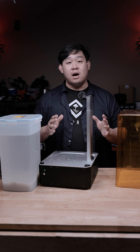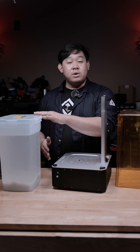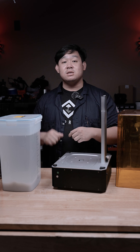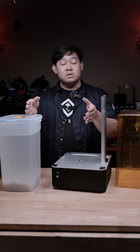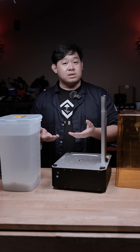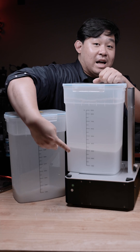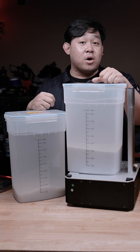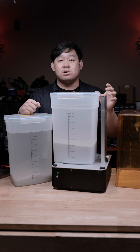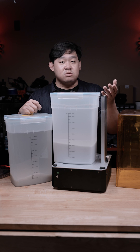I should mention though the process does result in the loss of some IPA depending on how much resin is actually in there. For example, this one is in my post bin wash bucket — I actually use two buckets to wash my resin prints: one pre and one post. The pre wash removes the bulk of the resin stuck onto the print, and then the post wash removes whatever's left. Comparing the pre and post bins, you can see a lot more resin got knocked out in the pre. Once a cleaning solution is saturated, it will still kind of start cleaning, but you'll notice a slimy film being left behind on your prints when it didn't used to do that before.